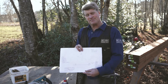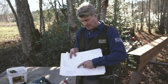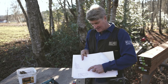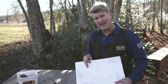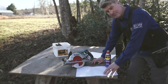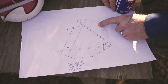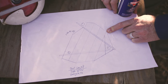To review, this is the plan for our beam layout. We've got the three main trees — one, two, three. The fourth tree we installed a paddle tab, and we already have that joist running past tree three and sitting on that first beam. It's always good to have a plan for your platform, and right here on this table I've got the platform plan. This is the joist layout. These single lines represent the joists — in our case, two by eights. I've got eight 14-foot two by eights right over here.